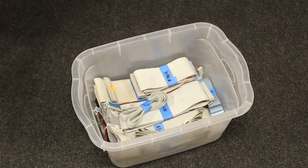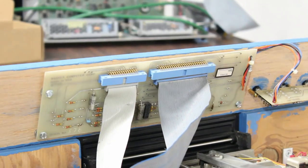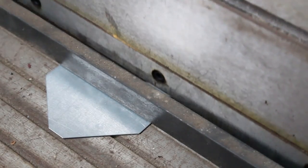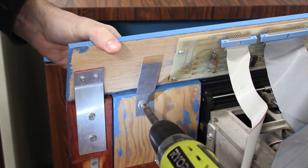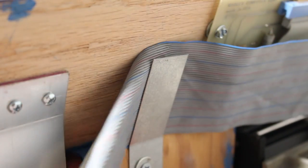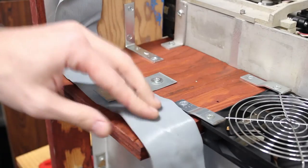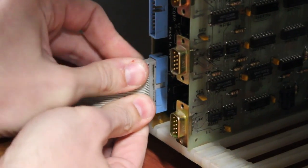That's going to move some air across the cards nicely. Next, let's get some ribbon cables run — I'll plug the cables into the front panel, then make some brackets to hold the cables in place: quick chop on the metal brake, drill a mounting hole, screw it in place, and slip the ribbon cables behind the bracket to firmly hold them. Rinse and repeat for a second bracket. The cables are now nicely managed — we'll plug the big one into the back plane and the small one into the CPU 6 card.